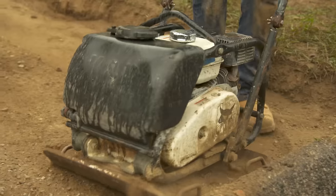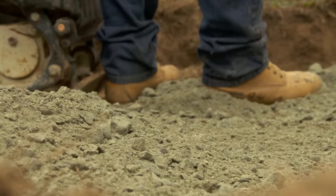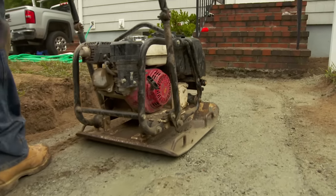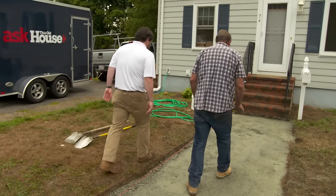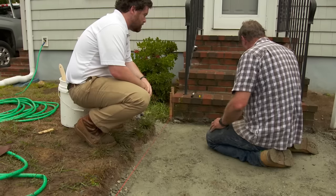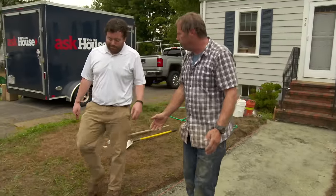We're going to rake this nice and smooth and then use the compactor to compact the base. Like any project around the house, the preparation is the key to a good job. We have layers of packed material — stone dust and stone mixed together — which drains really well. We put down 2 or 3 inches, compacted it down until we were 3 inches below the line, which will be the height of the new bluestone. We set a line at a 90-degree angle to the house using the 3-4-5 method: 3 feet one way, 4 feet the other, and the diagonal measures 5 feet. It's true and ready to go.